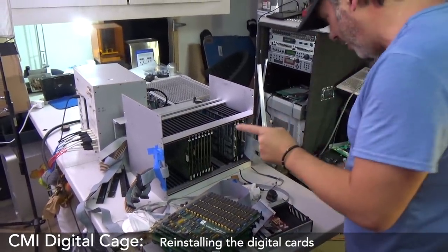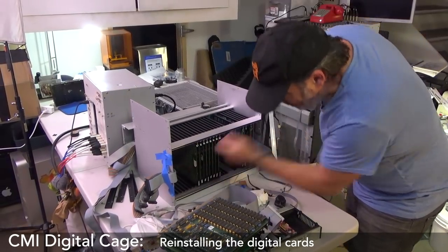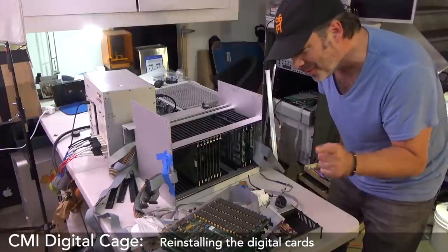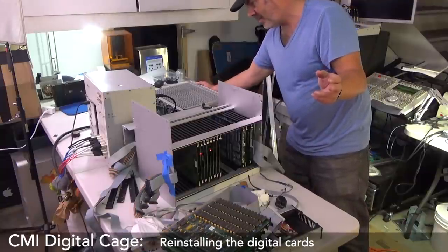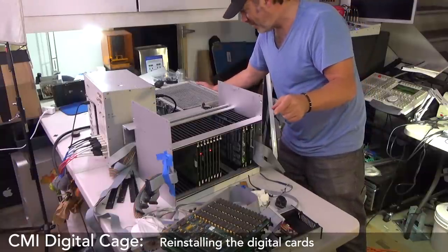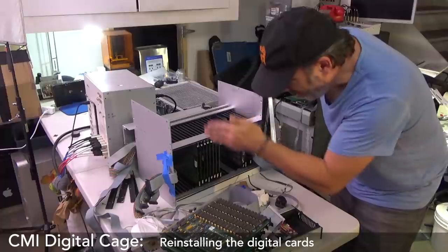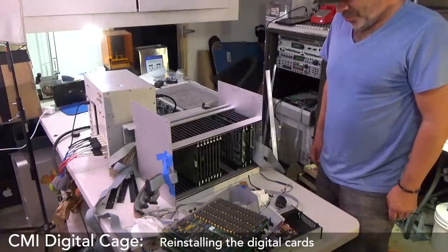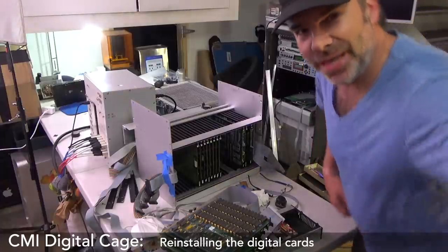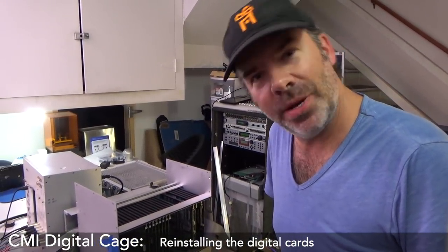All right, quick update. It wasn't powering on. It was crowbarring. It was protecting itself. And I'd taken out the little blue register things. Remember I said that was not good? Anyway, I took out as much as I could. Took out three memory boards and power. So it was these three memory boards not being registered in properly and being offset that told it to crowbar. Boom! All right. So I said I'm glad I'm gonna be getting a chance to put in those little blue things to actually keep the cards in place. And now we'll get that chance. Great.